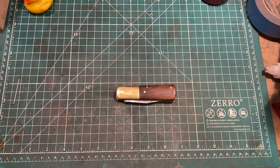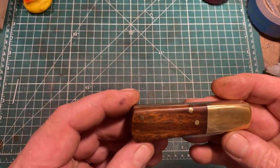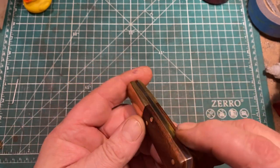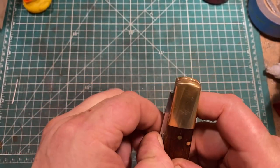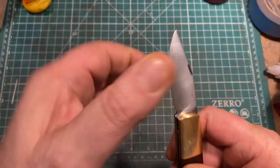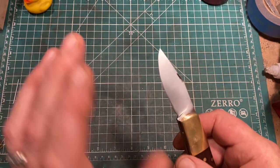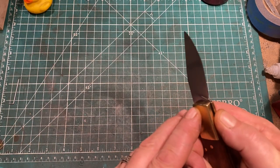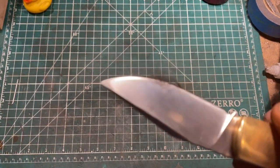Let's have a look at the prize on the tabletop. First things first, let's unload and show clear. So this is modeled on a traditional Barlow knife — pretty popular style for a couple hundred years. It has bronze liners, brass bolsters, brass pins, and the blade is a flat ground blade of O1 tool steel with what's called an appleseed edge, where there is no distinct edge bevel. And it is shaving sharp, as you can see.